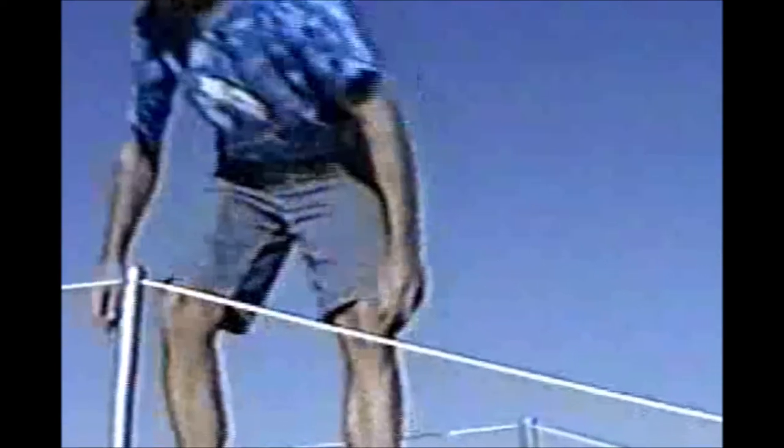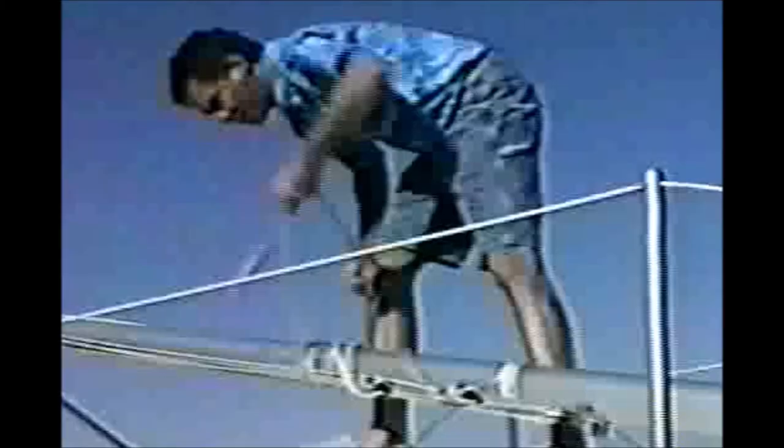I get it right about to where it's going to hit the mast plate — when it's approximately the right length extended, I just sit on the mast and that holds it in place. Pick up the bolt from under the centerboard cable, align it through the holes in the mast step plate, and pick up the nylon lock nut and give it finger tight — I've never had one come loose. I do carry a spare kit of hardware for everything on the boat. The main nut is a 9/16ths and the other main nut I use is 7/16ths. Here you can see two plugs: the regular plug for the masthead light and a second plug for the anchor light added for overnight camping, controlled from the same masthead switch on the fuse panel inside.